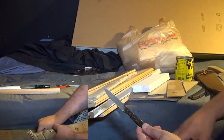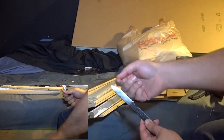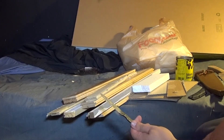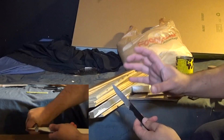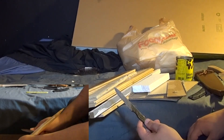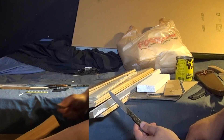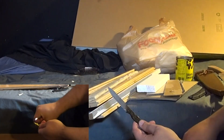With the edge between 5 and 10 thousandths thick, I repeated all the cutting — no damage again, except the actual final apex rolled a little bit. By this point I had abandoned the foam and cardboard — they're just too light, you really can't damage the edge with them at all. Pine wasn't doing anything, hardwood wasn't doing anything, plywood wasn't doing anything.